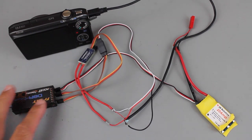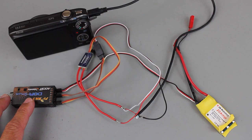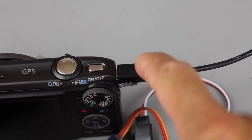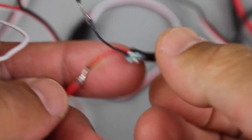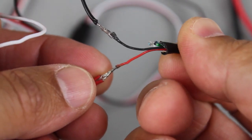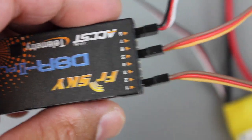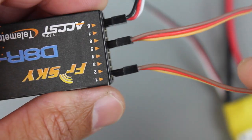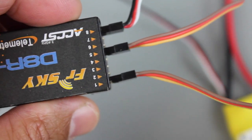Even though there's a mess of wires here I wanted to basically leave everything exposed so you guys could see how this thing gets wired. Starting with the cable, this is just the standard Canon USB cable that comes with your camera and I've clipped the USB end off of it, exposing both the positive and negative terminals. The negative end of the USB follows all the way down to a channel on the receiver - Channel 1, which provides five volts out of that channel.